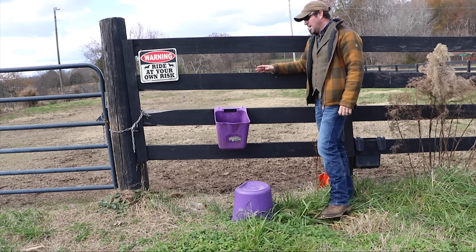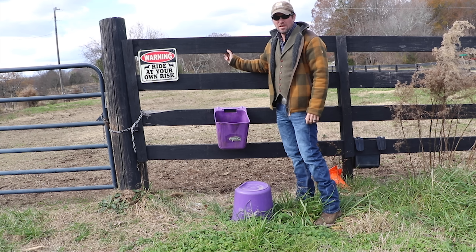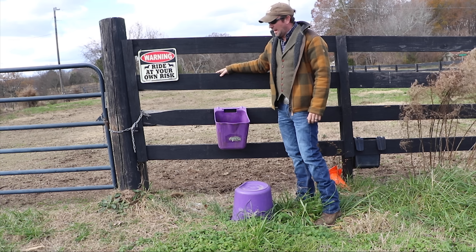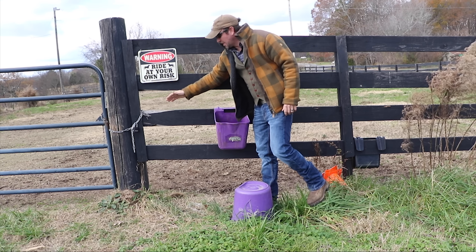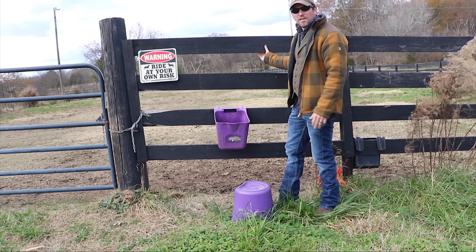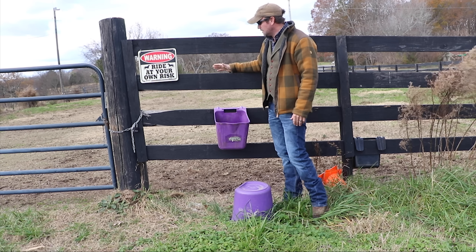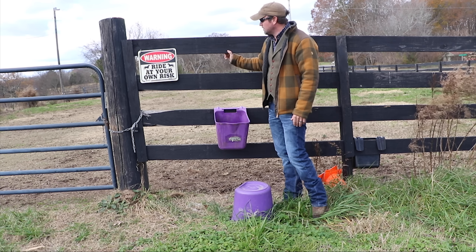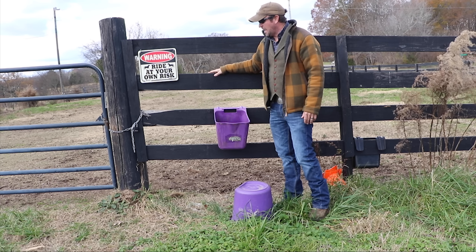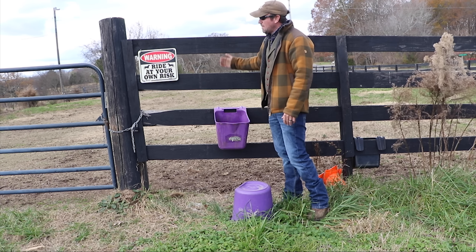The next material mistake I've made in the past is using what I call dollar boards. These are miscut boards from a local mill; they sell them for about a dollar. They're one-by-sixes but they're untreated, and they have some rough edges on them — that's why they're a dollar. These boards were a really cheap idea. Our boards have held up and they're all up here, but after several years they feel a lot drier than a lot of our other boards. The paint soaked in pretty well but it's starting to fade, and I've also noticed these boards tend to warp. We have a lot of warped boards along our fence line. They're just drier and weaker.